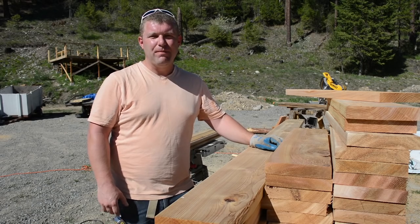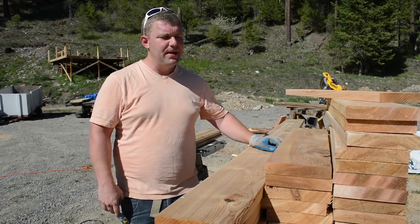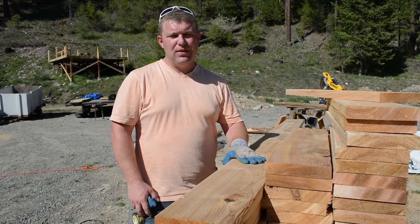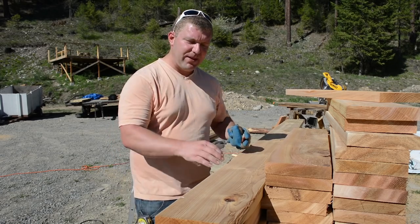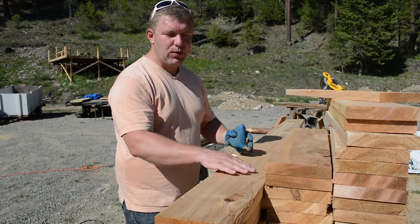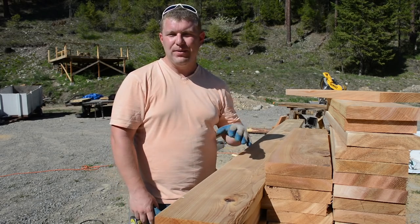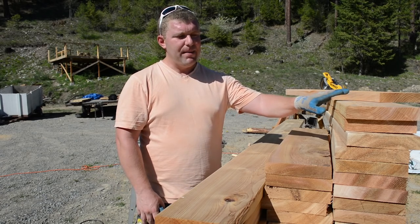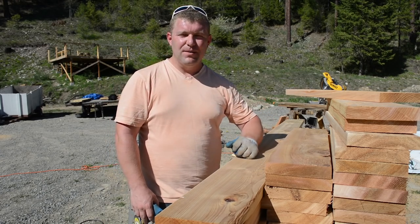All right, I'm all done with my cross cutting for the moment. There are some boards I'll have to cross cut one more time, but I've tried to get the maximum amount of wood out of each board — some of this will actually be spare wood. Some of this wood is more effective if I rip it down the middle first; for example, I might be able to get a stave here and a stave over here, but if I cross cut it now I'll lose one or the other. So some of the longer boards we're going to rip first, then cross cut just what we need.